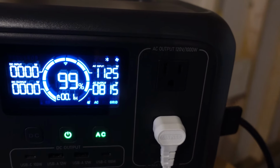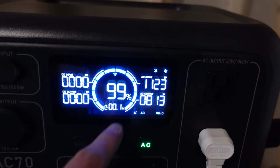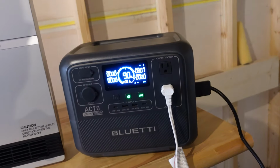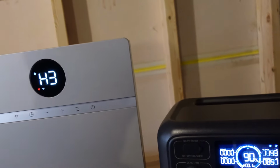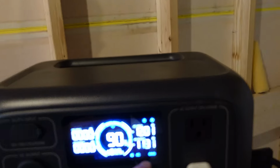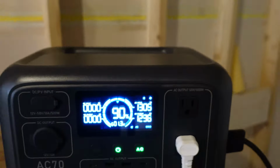They mention things like kettles and electric blankets, things like that are not going to be so high initial current draw. So I know that's a little technical for you, but up to 2,000 watt resistive loads is pretty impressive, and I've been able to coax a little more out of a heater. So I'm impressed with that too.